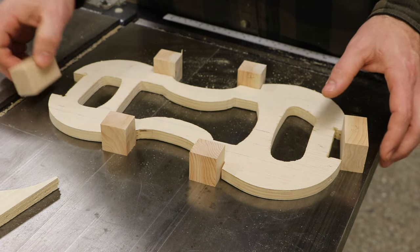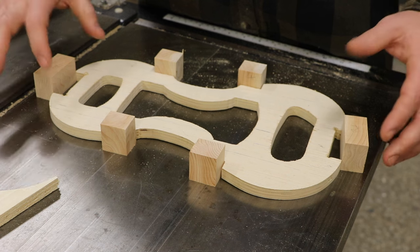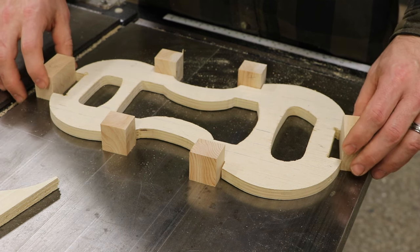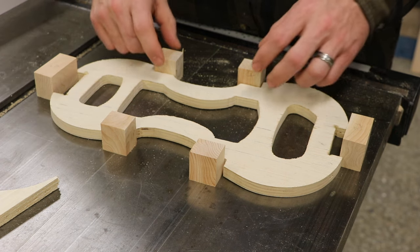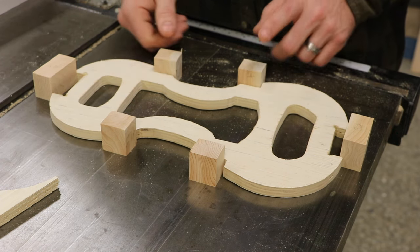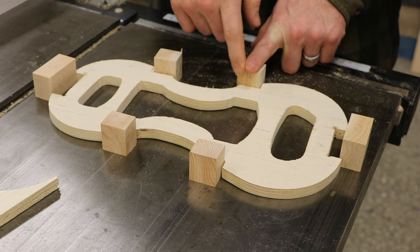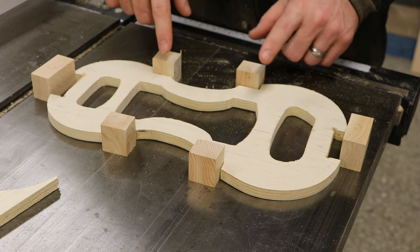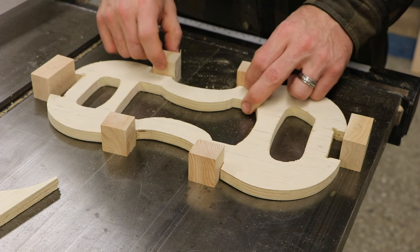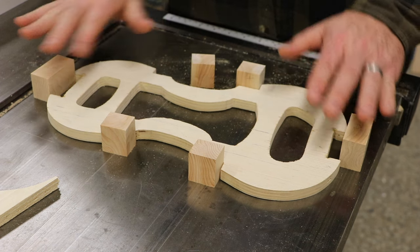And so at our top right now, I have it slightly oversized at 31 millimeters tall, it's 52 wide. I don't know what that is in inches. When I do instrument work, it's all in metric. And the sides, these are 32 and a quarter for the bottom bouts, these bottom corners, and it's about 31.75, a little over 31 and a half for the top side. So it starts that curve already.